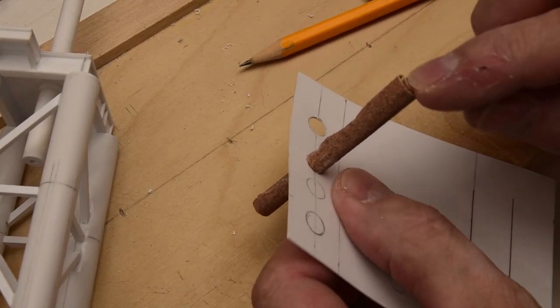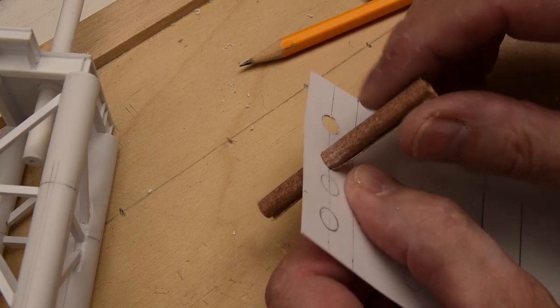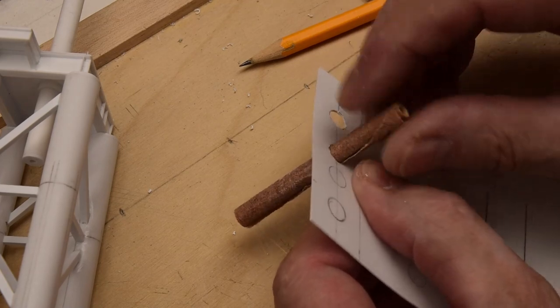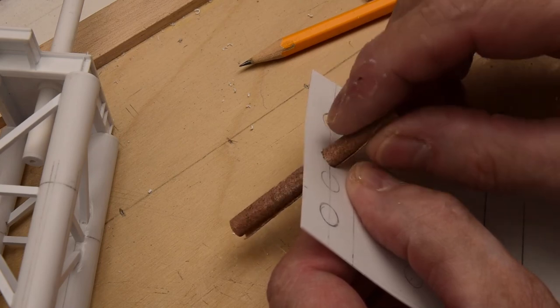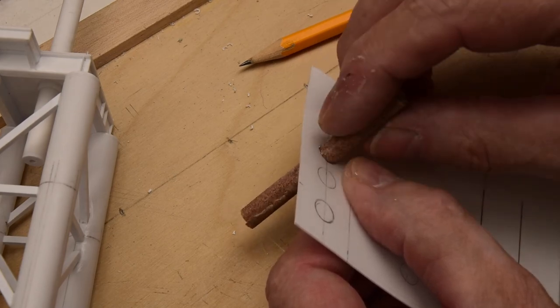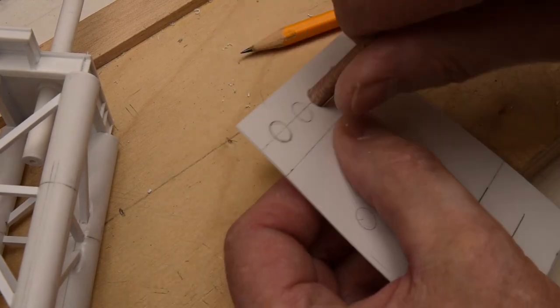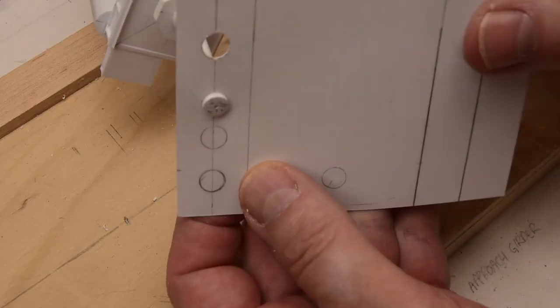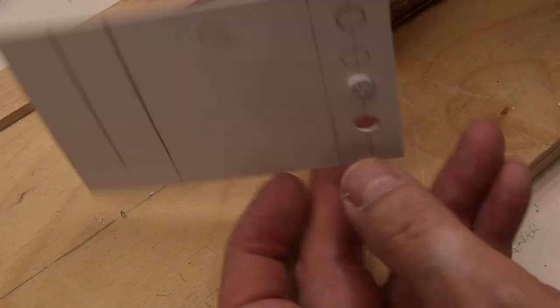And then when I insert this sandpaper, when you get it into the hole, make sure you turn it so the sandpaper wants to unravel. Don't go with the roll. I mean, you can sort of, but if you go against the roll, it'll grab sometimes. Just work it back and forth. The more you go against the roll, it's going to expand outward, right? And what happens is you get a perfect hole. Perfect hole. You can't see any light through it.